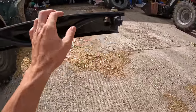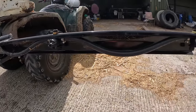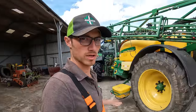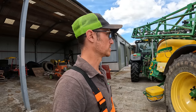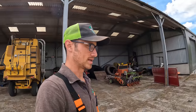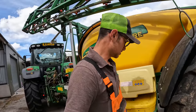Phil has taken off all the nozzles — you can see they're missing. They have a little filter that sits up inside, and they're all bunged up with rubbish, so he's taking them inside to clean them. Then we'll flush a load of water through it, and hopefully this sprayer will be ready to do the little bits around the outside that I haven't done. When spraying glyphosate you really need to wash the sprayer out afterwards, but the next thing it'll be used for is spraying off our corn stubbles before they get ploughed up, so I'll wash it out properly when we finish that, before we put on pre-emergent.